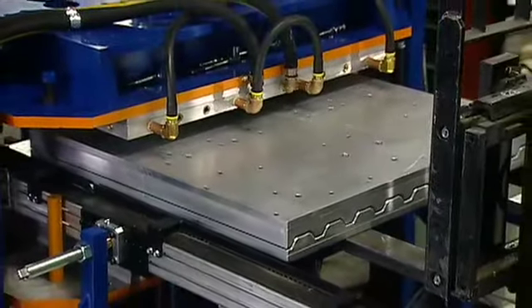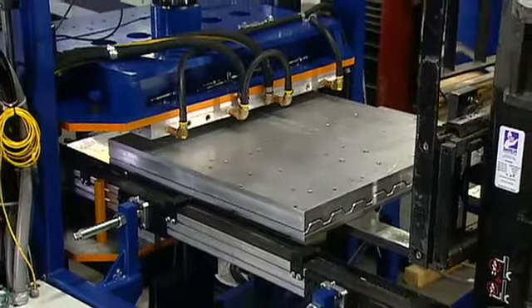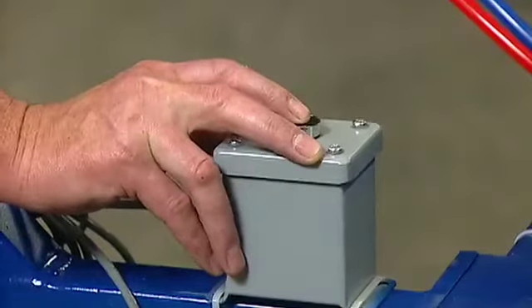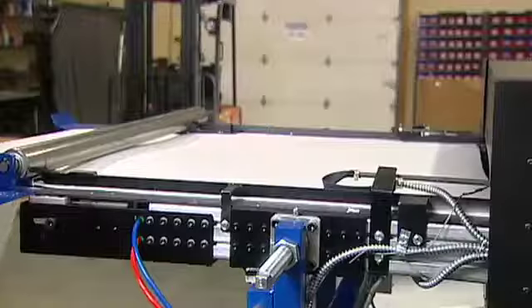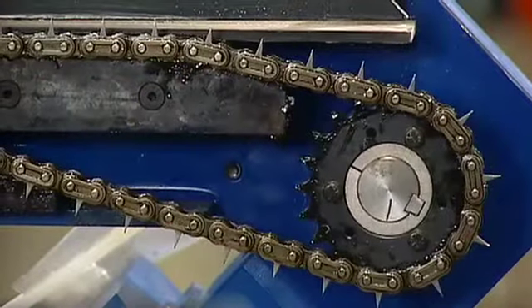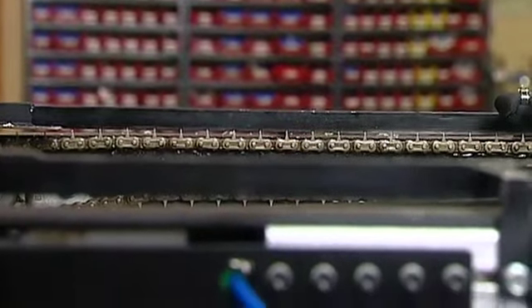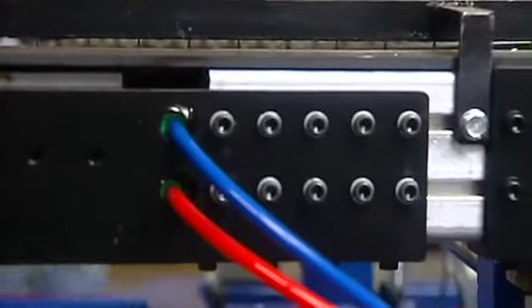When we do a mold change, you'll be able to see how easy it is to get right in there and change that mold without the linkage being in the way. These chain rails have a button — on the first cycle it'll run slow. The Wonder button will slow it down to maybe 50 inches per second, allowing you to get the sheet started. You push the button again and off it goes. These chain rails are built through an aluminum extrusion, so we're sending cooling water right down the rail and back. It's a real clean, neat setup and all the rail components are cooled.